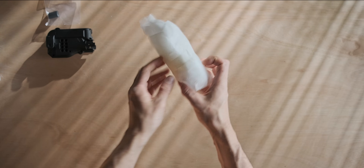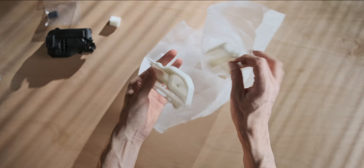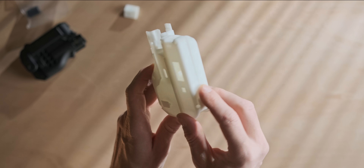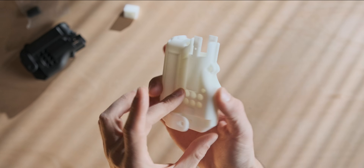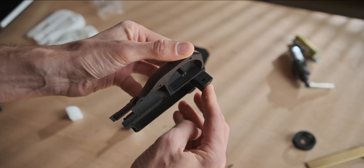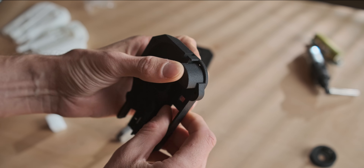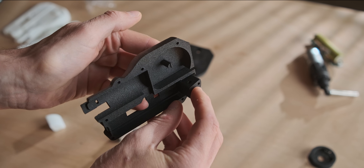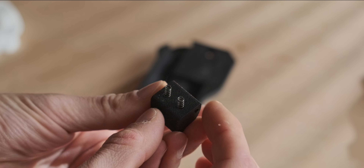In terms of the resin version printed in white, I wasn't too big a fan of that one because the other components are black and it doesn't really match up. But if you want to see that version with all the components installed, you can follow me on Instagram and I'll upload a picture there. The design we ended up with was pretty simple - there's this triangular button with a spring in there, and that activates the second button which was initially used for the pump action activation thing. There's also another button on the other side where you can switch modes.